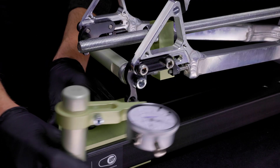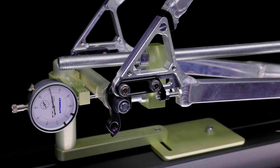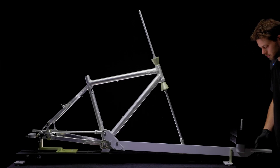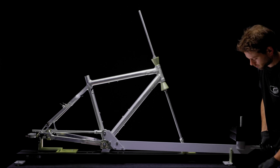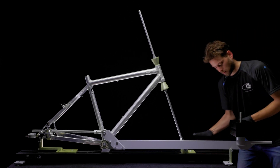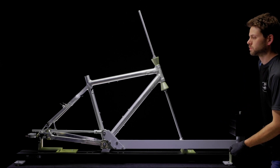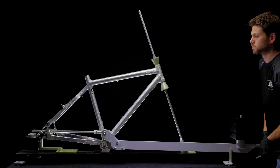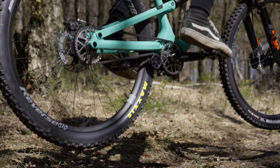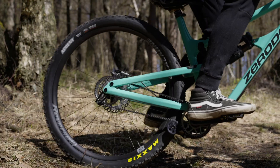The setup geometrically represents the use of a sprocket with 50 teeth in the front and 22 teeth in the rear. The 100-centimeter-long lever arm weighs 10 kilograms and, for the test, is loaded with 18 kilograms at its end position. This corresponds to a torque of 181.5 Newton meters at the pedal crank, or put another way, a cyclist weighing 106 kilograms standing on a 175-millimeter crank.